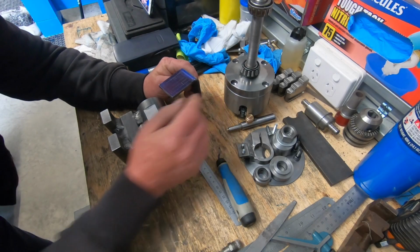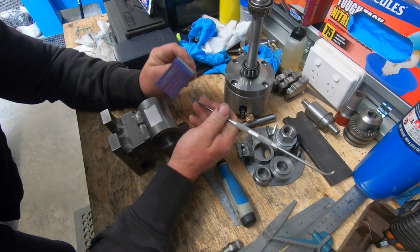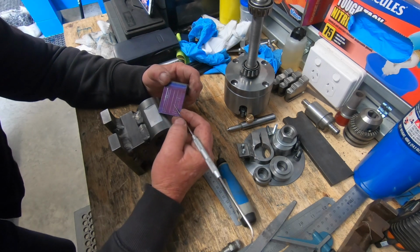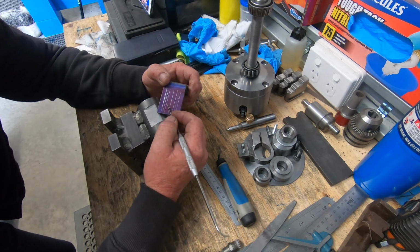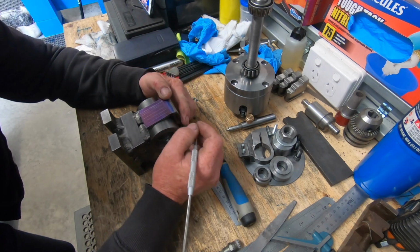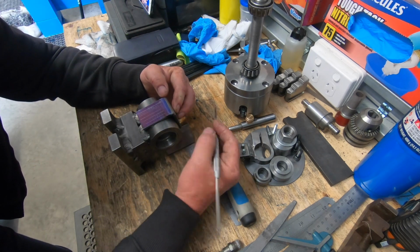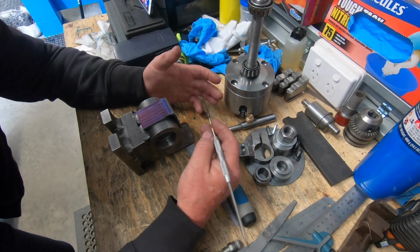What I've done here is I have marked out the holes, or the slots should I say, in the plate that's going to go on the side here. I've marked out a 6mm slot on each side, marked out top and bottom hole on each for the start. I'm going to put a little pilot hole in the tops, and then put them on the plate here and get it all squared up, and transfer them holes, them marks onto the body, and then I know I'm spot on. Then I can't make a mistake when I'm trying to measure it out and set it out.